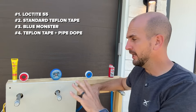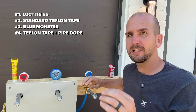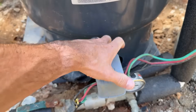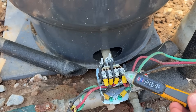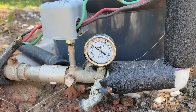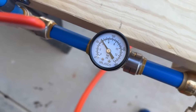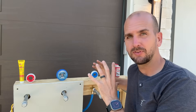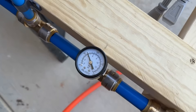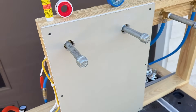Now we're ready to test. We won't have flow like last time — we're just pressurizing and capping everything off, aiming to get close to 60 psi. I made a little adjustment at the well and noticed the on/off switch for the well pump was set pretty low. With some adjustments we got it up to close to 60 psi, and at the test stand you can see we're right over 60 psi. We're pressurizing for 30 minutes — and after running for about an hour, we confirmed we were holding pressure the whole time.